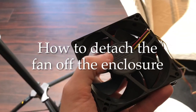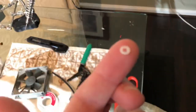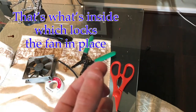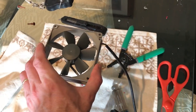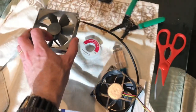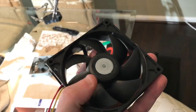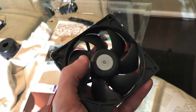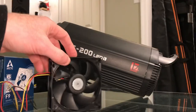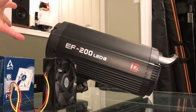Remove the sticker on the fan to find a little hole, then pry it open. Use a toothpick or tweezers to remove the small washer that locks things in place — this is the only way to detach the fan from its body. On the dummy Jinbei fan, after removing it, cut the blades as close as possible to the hub. Apparently this doesn't alter the electrical behavior — the purpose of this dummy fan is just to add enough load on the board so it doesn't make the LED flash.